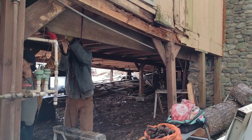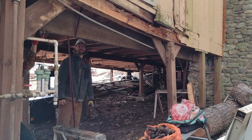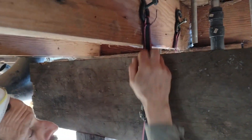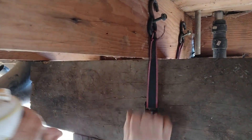In one section where it was heavy, we put an extra ratchet strap on so we could release one side and then ratchet the other up. A lot of times with beams of the sizes I'm talking about, you can just hand-lift it with two guys, readjust the ratchet strap, and suck that beam all the way up to the joists.